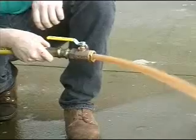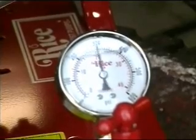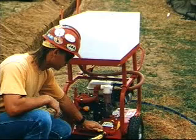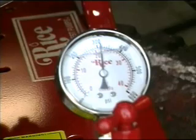Fourth, connect the outlet hose to the test environment and allow the unit to build up to your required test pressure. Once pressure is met and the air is bled from the system, close the ball valve on the unit and shut off the engine simultaneously. Allow the unit and test environment to sit, holding pressure for your required test time.